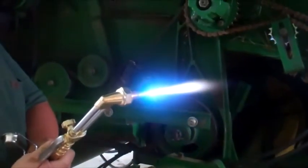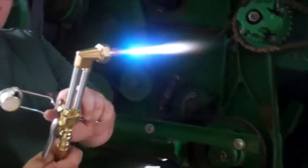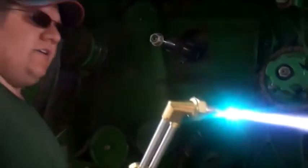What are you looking for when you do that? See how there's way too much flame? It's orange. So you want to get a nice blue flame. You see here at the tip where the blue comes all the way out — you want it to come down to about right there. And that'll cut it.